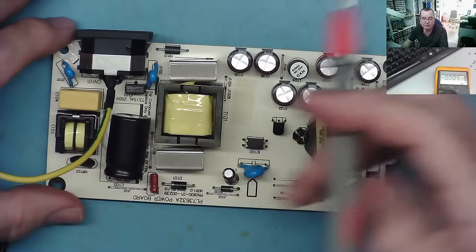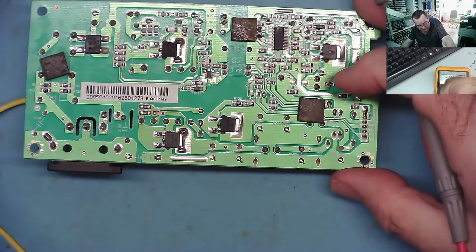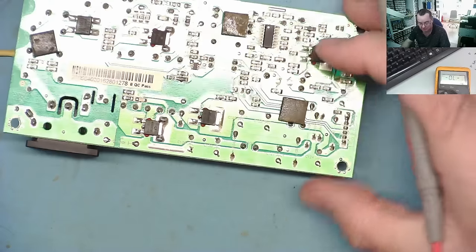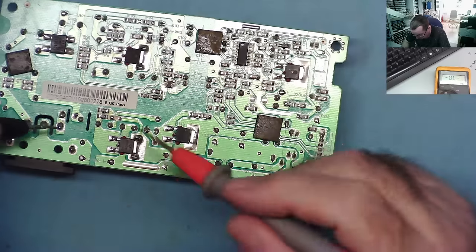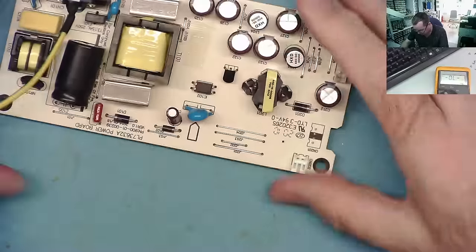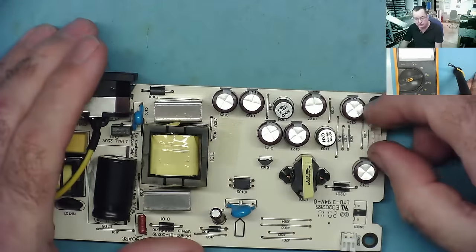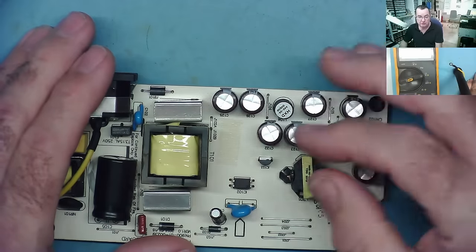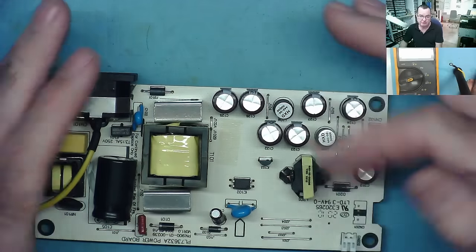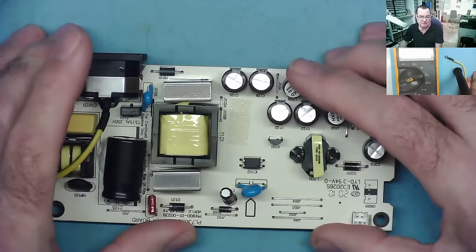I've just noticed this is actually a fuse, but I'm sure the fuse will be okay because there was voltage in this thing — unless it's been there for a very long time. Let's have a look. Fuse reads okay, I didn't expect it would be otherwise. Most likely then, this either isn't starting at all, or there's a short circuit on the output to the monitor's control board, or there's a short circuit in this lot — effectively putting the load on this output because this voltage rail drives this regulator.